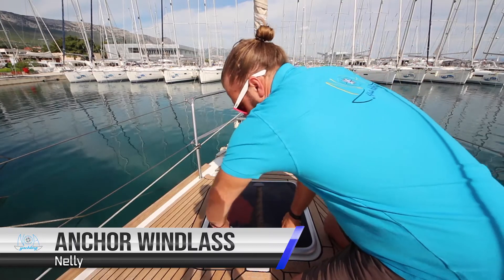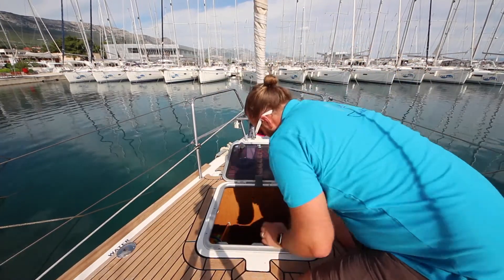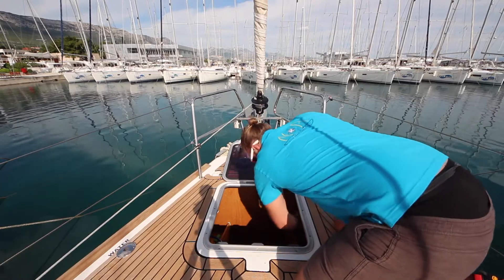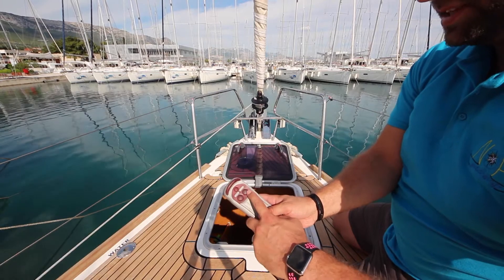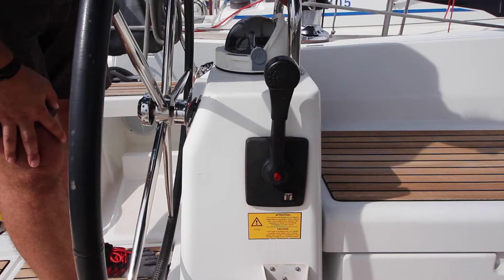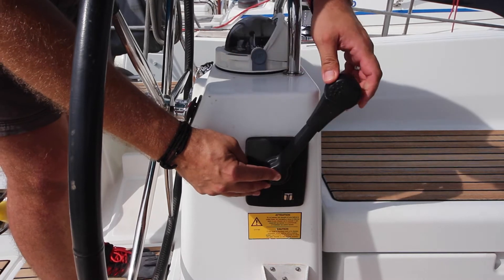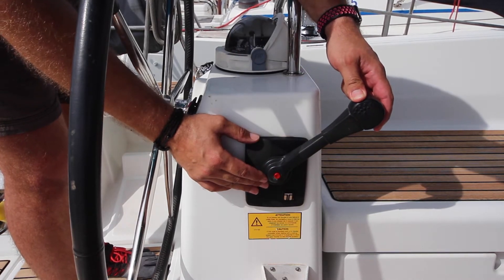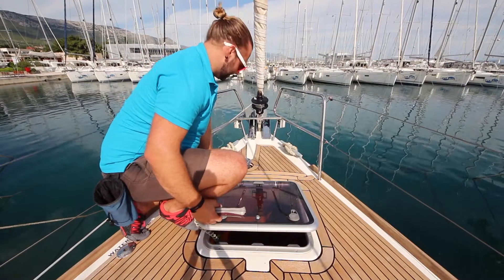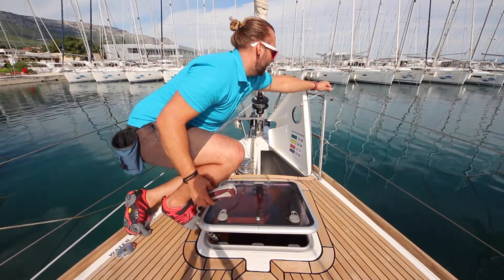When anchoring with the control from the bow, open the forward hatch and remove the anchor control from the cradle. This has two controls on it: up and down, controlling the main anchor. When anchoring, put the engine in neutral and apply 1500 to 2000 revs to help charge the battery while you are anchoring. It's important to lift the forward anchor hatch and secure it in place.